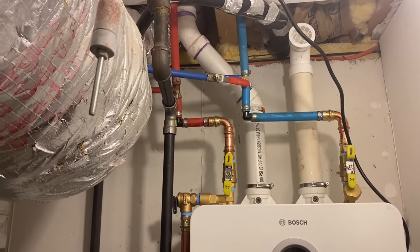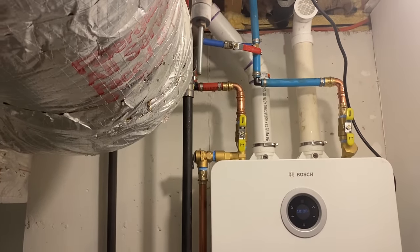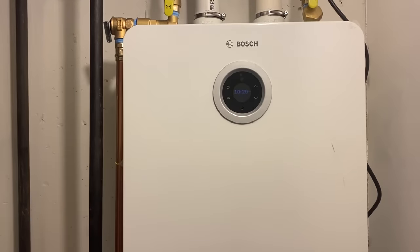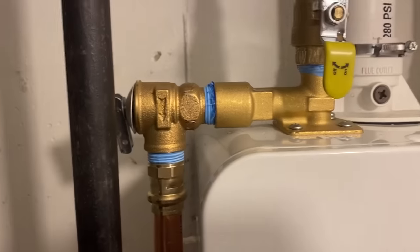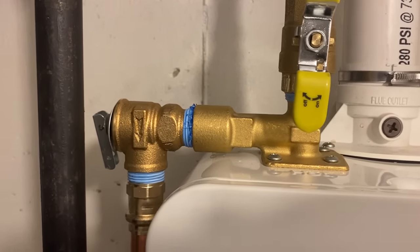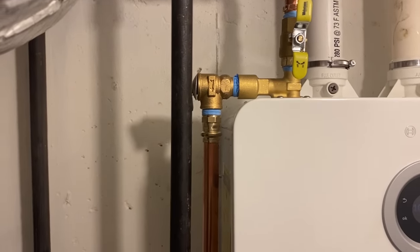Venting: two-inch up to 60 feet — don't forget to account for your fittings. Those 45s and 90s add footage to the total developed length. We've got a stainless steel heat exchanger inside, very nice. We have the pre-screen filter right there on the domestic cold water inlet. And most importantly — I love this — on the opposite side, domestic hot water out, we have the built-in three-quarter-inch female tapping made for the included relief valve. The relief valve is included on models for indoor installation.